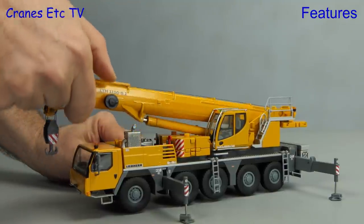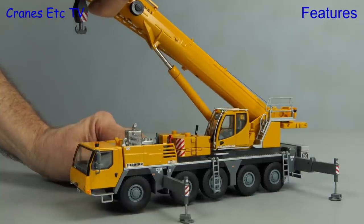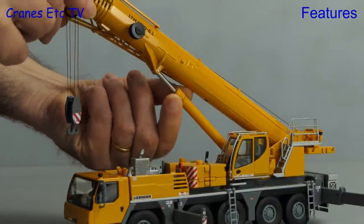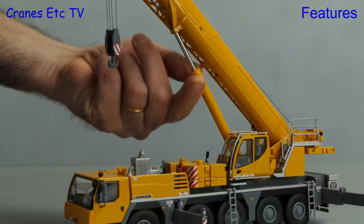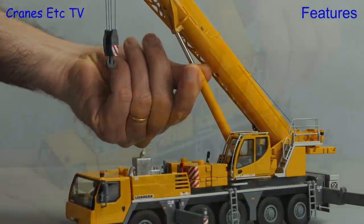Unhooking the hook and getting ready to raise the boom — out of the box the boom raises smoothly enough, and it has an interesting way to lock the extension that you want. You lock and unlock it by rotating the collar at the top of the ram jacket, which effectively acts as a clamp on the piston. It seems to work well enough and you just have to make sure it's good and tight when you reach your chosen angle.